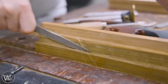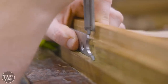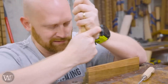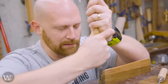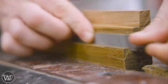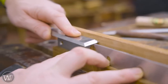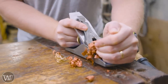I needed to come in with a file and remove a little more so it would work down in there, making sure I get exactly a quarter inch depth all the way along. You can see how the skate fits down into that groove running right alongside the rabbit. The plans say you can use a table saw — the skate is made to a standard table saw kerf thickness. But I decided to do it the hard way, because that's what this channel is all about.